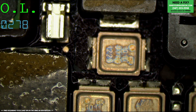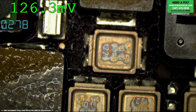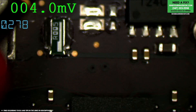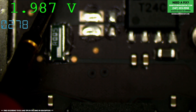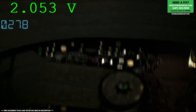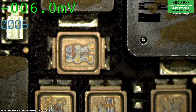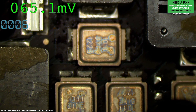Which one is it? I can't put more than a volt into this, because if it is actually shorted, that means I'm going to be sending two volts to the GPU, and that's very bad. PPBus is shorted — I'm getting two ohms, two volts. This is the only area that's hot. It's got to be one of these GPU MOSFETs. If he was having random crashes and then it died, it's a GPU MOSFET. I'm going in.